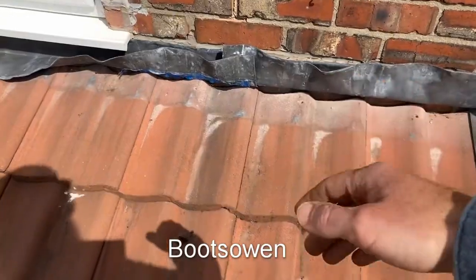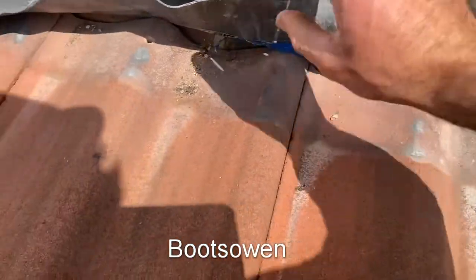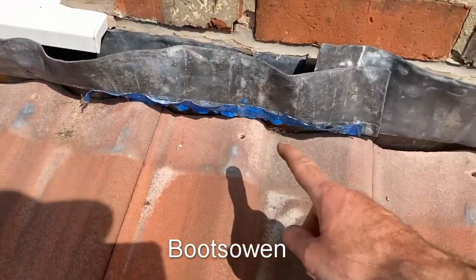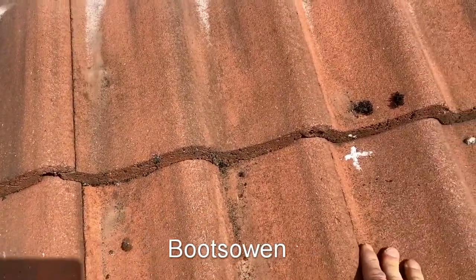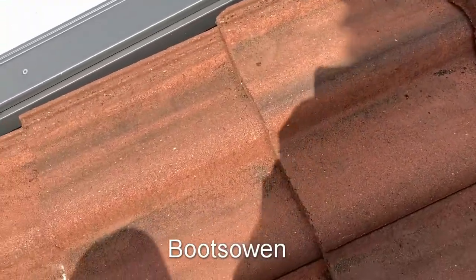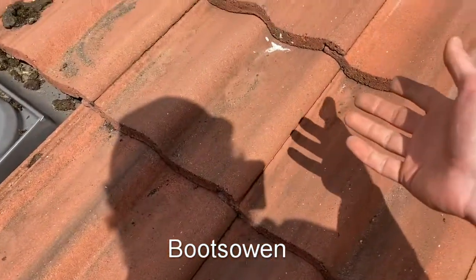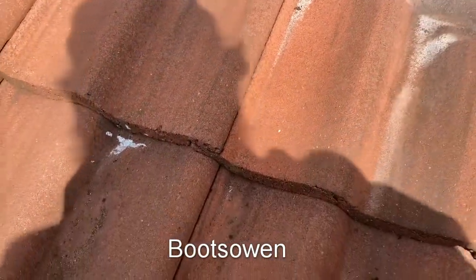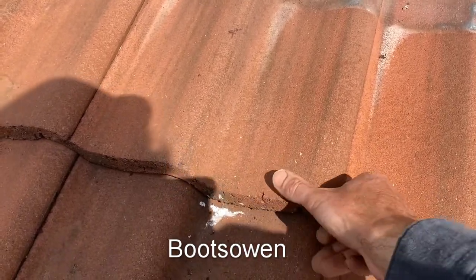I'm on the other side of the roof now. Up at the top there was a lead flashing — you just get it with your hand, pull it up and push it back. Pretty rudimentary really. The tiles on top were cut a little bit shorter and were screwed in with posi-drive three-inch screws, so that was quite easy to get them out. Then we're going to have to take out tiles here and here to get a bracket in, and all the tiles down as far as here. The simplest thing we found is just to take all the tiles out in a run.